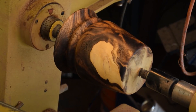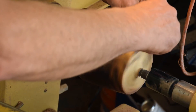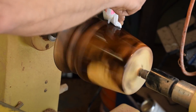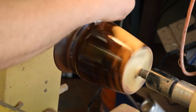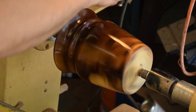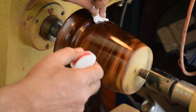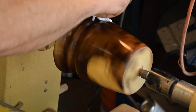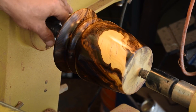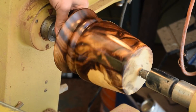The grain on this piece is pretty incredible. There's some of the cambium — the outer edge, the light part before you get into the actual wood — and then it's got just some stunning grain in it. It's going to be on fire once it's out in the sunlight. This ring shake is really making me a little nervous because it looks like this whole piece right out here could just fly off. So I'm doing another coat of thin CA to try to bond everything together real well and seal up all the end grain.